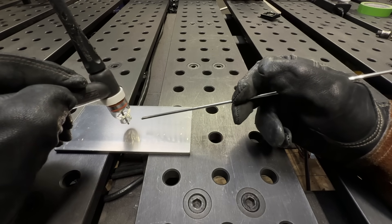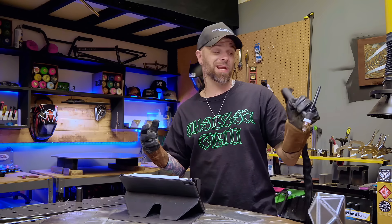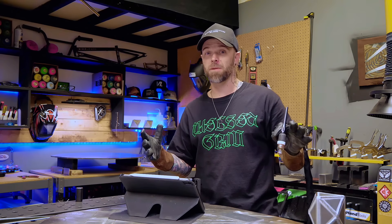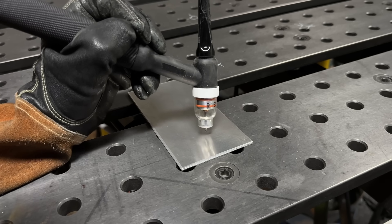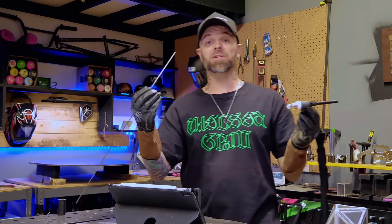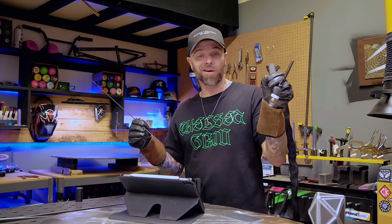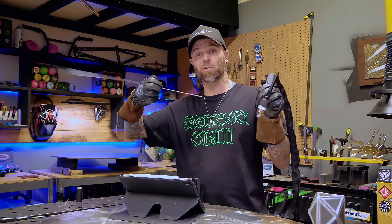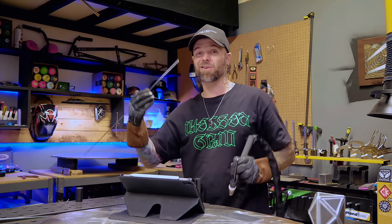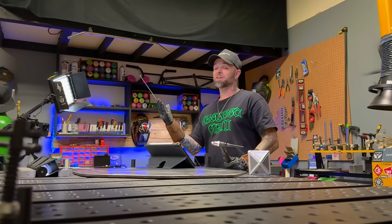Go as slow as you want — don't rush this. Advancing and doing dry passes with your torch hand is extremely comfortable for a lot of people, but feeding the filler material is notoriously difficult. Let's use the one thing we are comfortable doing — dry runs — to actually help guide us with the one thing we aren't rock solid with yet. We're just going to use this as a guide to help teach this hand how to feed. You can do it fast, it'll take like five seconds, or you can go as slow as you want.